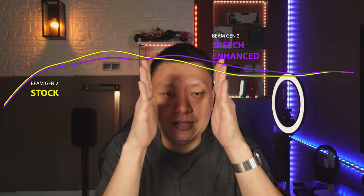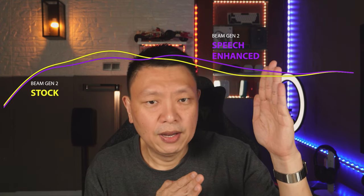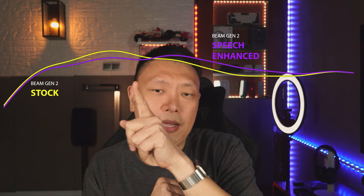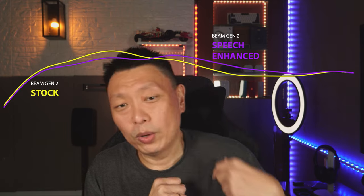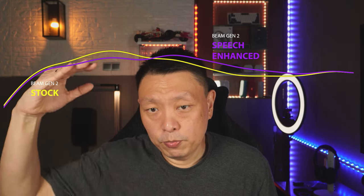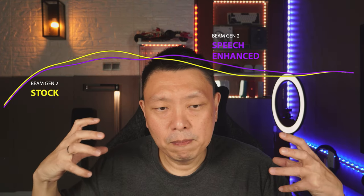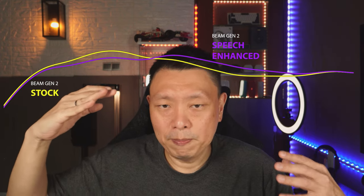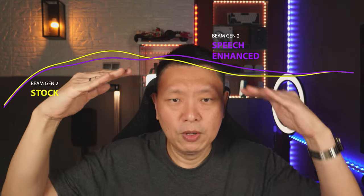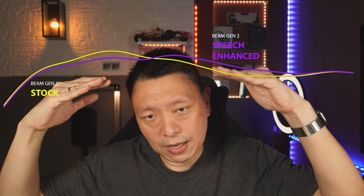And you see what it does is that the mid-range gets boosted up quite a bit and it goes on right to about 2 or 3 kilohertz even. So the human voice, right? Actually, male voice starts from maybe about here. So the male voice end is lowered a little bit. So less of a boom, less of a bass response so that it doesn't get that muddy and you'll be able to hear voices, vocal ranges a little bit better. So it's more intelligible. And the mid-range response is actually then boosted up slightly.